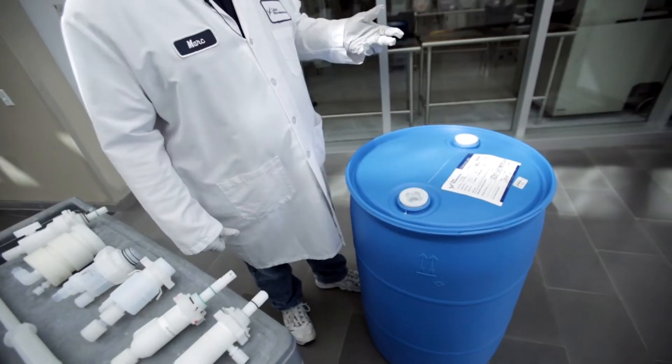In general, if you're going to do pump recirculation, using separate feed and return is the safest way to do it. You have the least amount of potential issues from slurry splashing, foaming, drying, etc., if you use separate feed and return dispense heads.